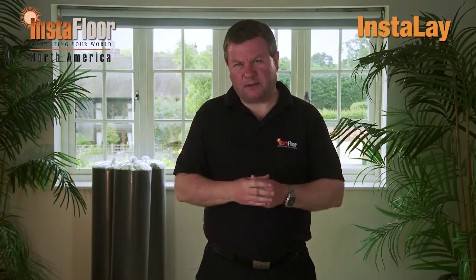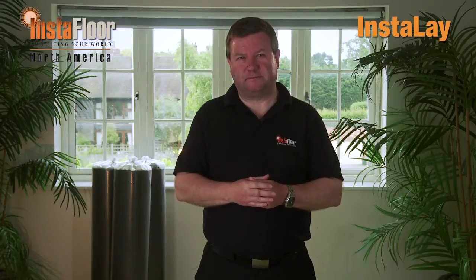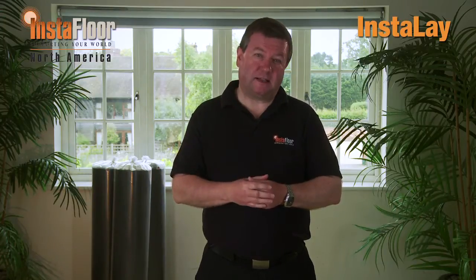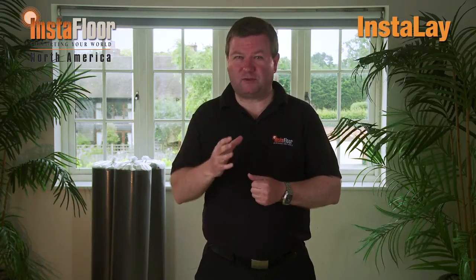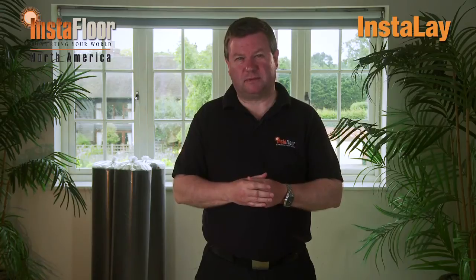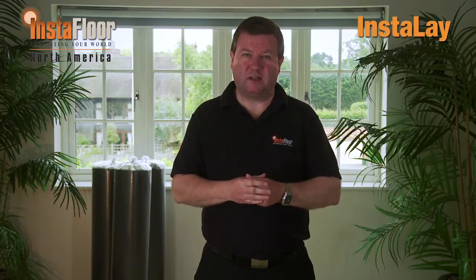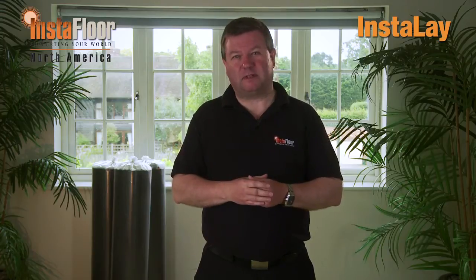So what are the real benefits of using InstaLay for the installation of luxury vinyl tiles? Firstly, InstaLay has the ability to mask minor subfloor imperfections, preventing costly screeding processes and thereby reducing installation times. Because InstaLay removes the need for wet adhesives, it prevents the risk of adhesion problems associated with using the incorrect notch trowel or late placement into the adhesive.